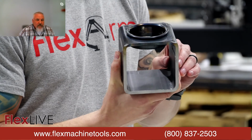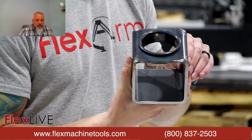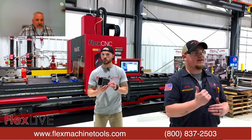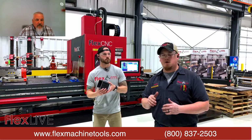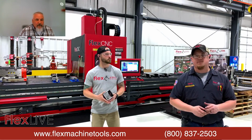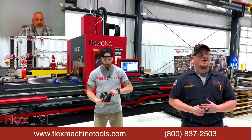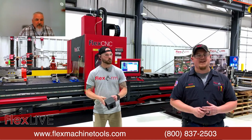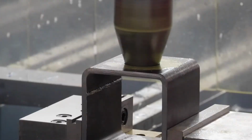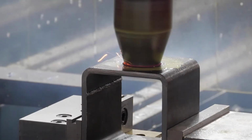There was talk about adjusting the spindle speed to make sure we're creating enough heat, and changing the depths so we weren't trying to push too hard on that transition on the tool. So I made some adjustments to the program, and Isaac, if you want to run that next B-roll, we'll... But it's all R&D. I can't stress that enough.